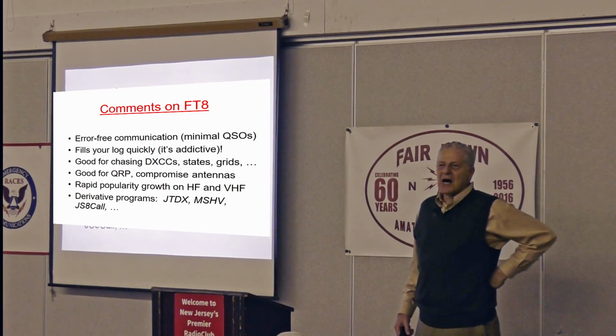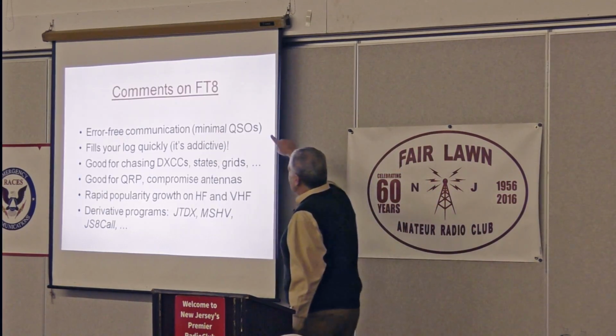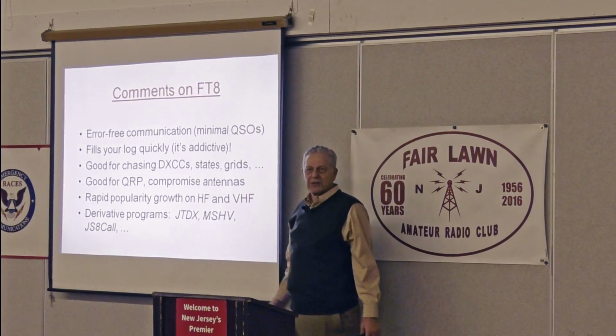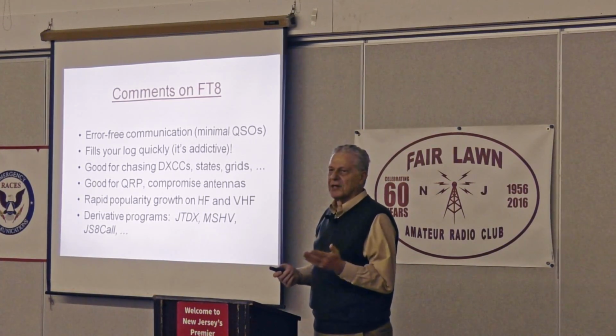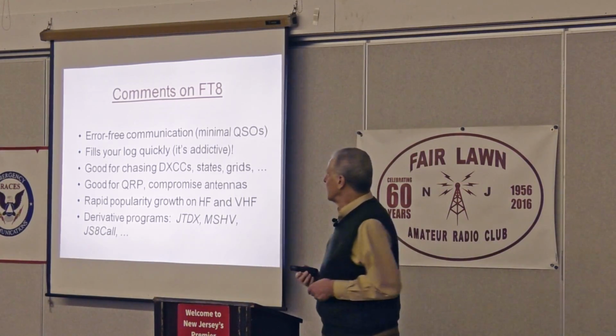Just a few random comments here about FT8. It does give you basically error-free exchange of very simple messages. You either get the message that was sent or you maybe get nothing, but you don't get garbage. So it's a little different from PSK31 or RTTY or other digital modes that have little or no error correction built into them.